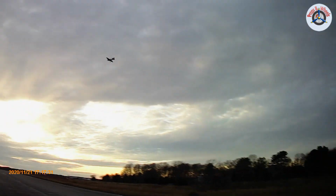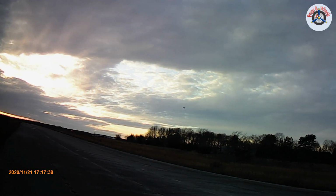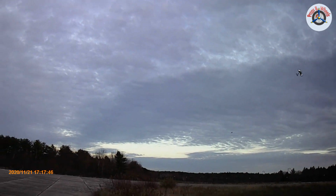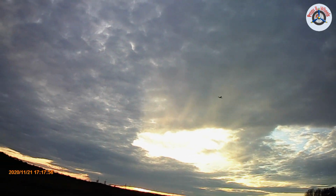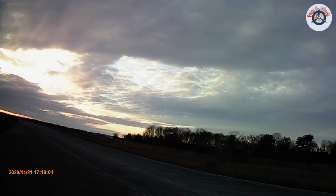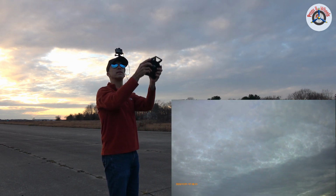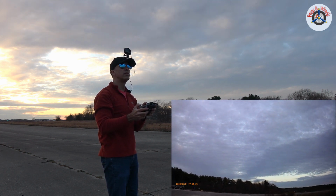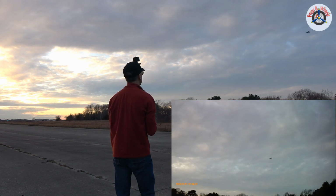And these controllers are really toy grade controllers. So what I'm going to do next is connect this airplane and the other Mini Warbirds from Eachine, all of them, to my Radiomaster TX16S, which has Hall effect gimbals and much better quality in terms of the gimbal sensitivity and accuracy. With this one, there are always some dead spots in the center, like nothing is happening in the middle, like 15% of the travel. Then you pull, and suddenly it pulls like 20%, basically goes up.